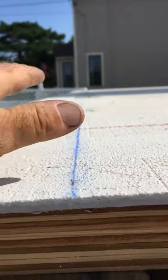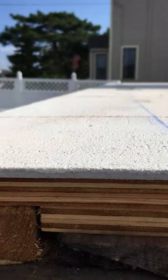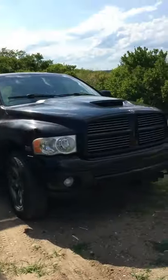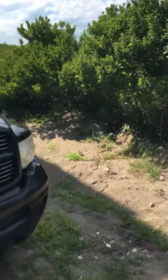There's a six inch wall — two and three quarters to the center of each side — and then a two by ten out in the front. It's a double wall: two by six and two by ten, where one bears and one allows for insulation and profile.